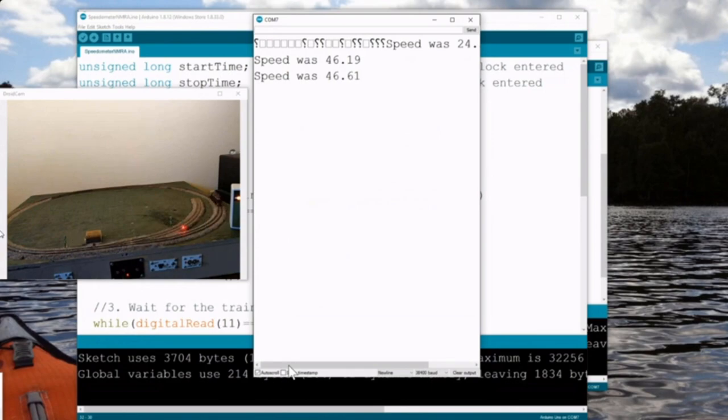This is a bit of a testament to how accurate the timing is if you do this, and also, of course, the feedback in the locomotive. The decoder is doing a very good job of maintaining exactly whatever speed it's supposed to for speed step 29 here. That one was a little tiny bit less. So there's the four main concepts that you need for programming.